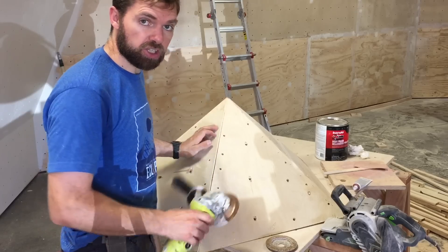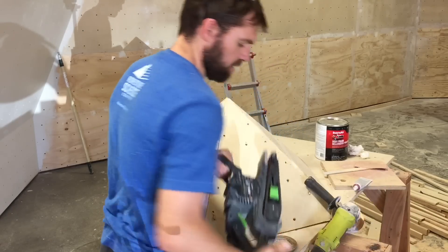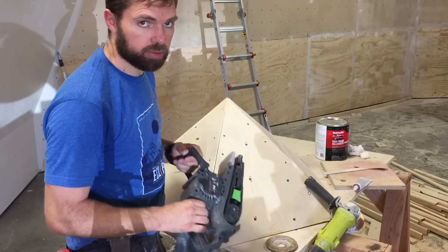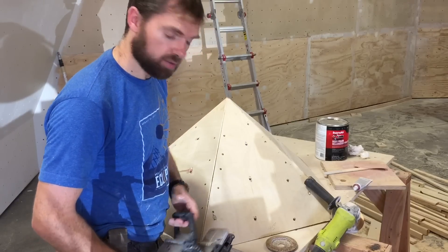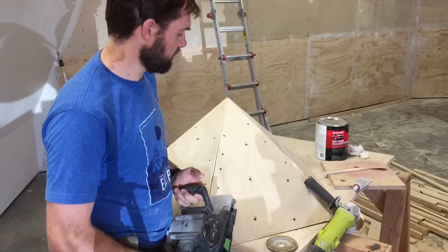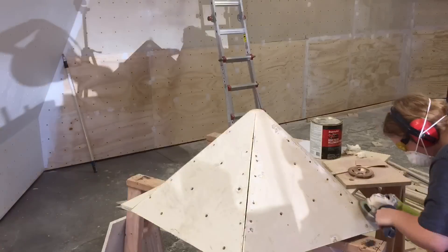Use two handles so you can carve it. You're making it look pretty — you're not just getting in there and roughing things up. The other thing that you can use is a belt sander. This is also aggressive, and for these angles like this, it's actually probably going to be the easiest. You always want to look after every pass at your work piece to make sure you're not digging in a spot that you're not supposed to be digging in. We're using the angle grinder here simply to be more familiar with the tool and how to use it in this application.